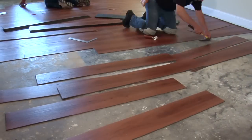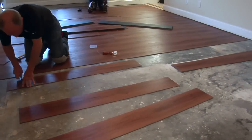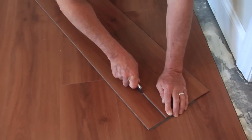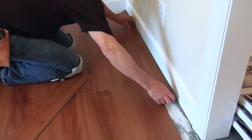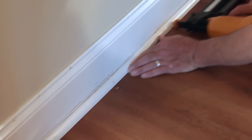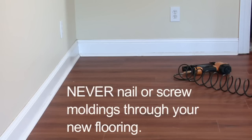Repeat until you reach the final row of material. To install the final row of planks or tiles, you will usually need to cut them. Lay a panel on top of the last row installed, then lay another plank or tile against the edge of the wall and mark the plank or tile underneath. Cut through the wear layer and snap along the score. Install the last row leaving ample expansion space. When installing moldings, make sure no nails or screws enter the vinyl flooring or the expansion zone around the flooring perimeter, as this will prevent proper expansion and contraction. All transition moldings should provide a quarter inch expansion space. Never nail or screw moldings through your new flooring.